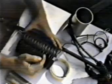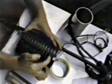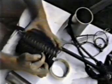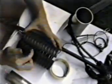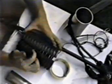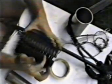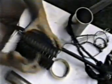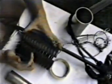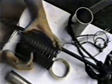I looped to the next. We got fine bubbling in between these, off that neutral plate, off the inside of positive, off the inside of negative, and still the fine bit on this end. I then went to centre, negative to centre. I got production off two neutral plates, inside positive, inside negative, nothing down this way. So I continued on down my way and it diminished right out to nearly nothing.